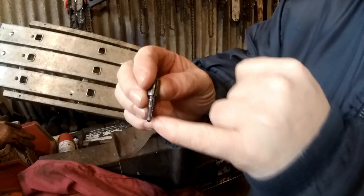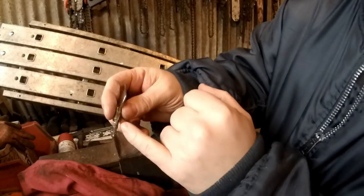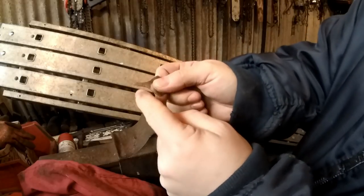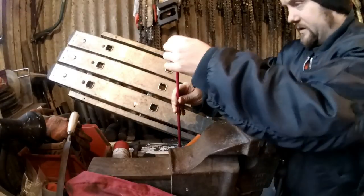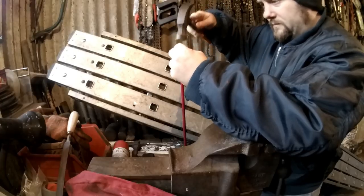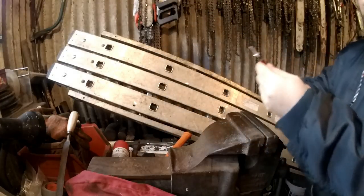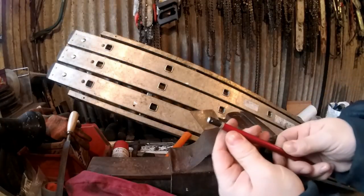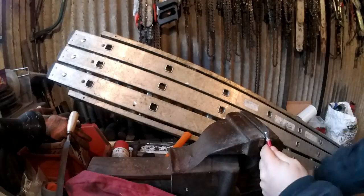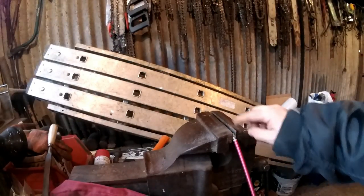Right, so I'll cut the slot virtually to the end. Hopefully I should be able to hammer this down into the bolt enough so that I could break that out. I will just need to file this edge down slightly more so it fits in better. I'll try hammering this down as far as it goes now. That's a lot better — it won't move now. So yeah, that's the method you want to do, really. All I need to do now is clamp that up again, tighten that up, and I'll shape the tip.